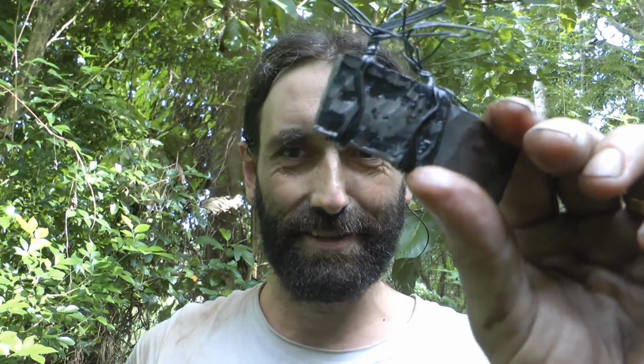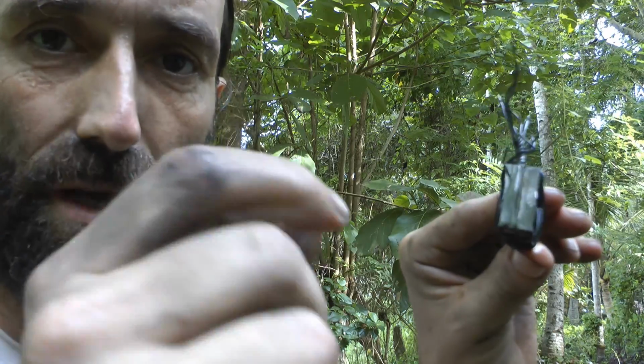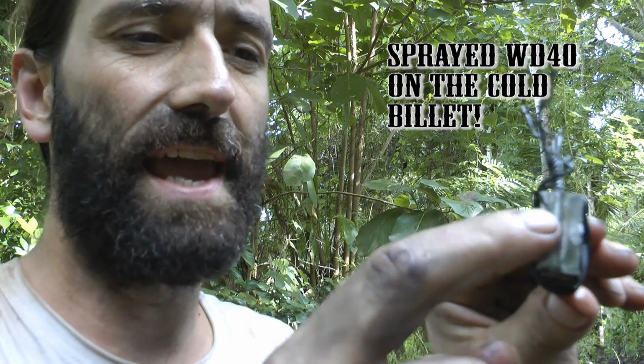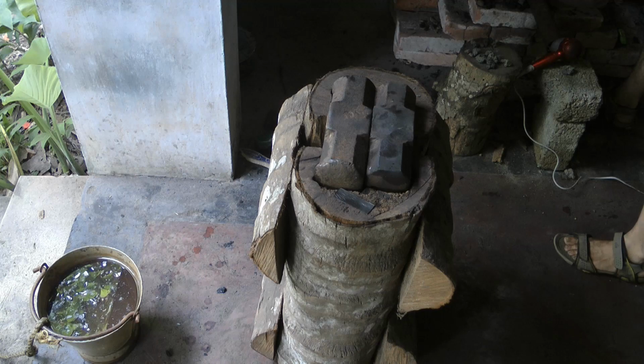Alright, here we go. Tiniest billet in the history of Damascus making, but for my first attempt, I am very thrilled with this. It's way harder than it looks. What I have here now is a carpenter's saw piece, one layer, sandwiched in between our billet. So that's 8, 8 and 1, 17 layers. That's the count we are up to at the moment. I can't go any more than that because there's hardly any material. And if I want to make a small little tiny garden knife that looks fancy with the Damascus, that's as much as I can probably go for.